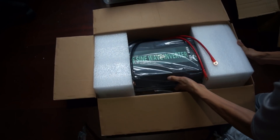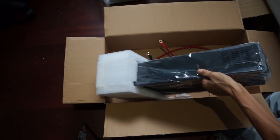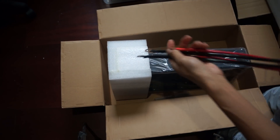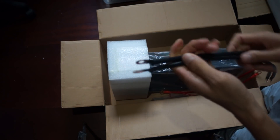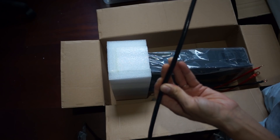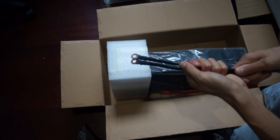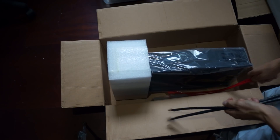The box is marked 3500 watts and 60 volts, so hopefully they did give me a custom one. 60 Hz, 120 volts — everything looks good. It's not as big as the box suggested. The only thing that keeps making me laugh is they always give you these wires with the inverter, and it's kind of a joke — they look like maybe 10-gauge, which isn't really big enough for 3500 watts. Don't use those wires.